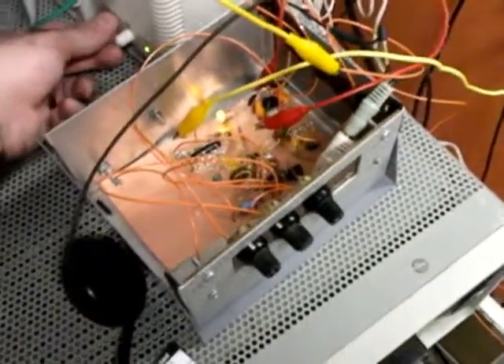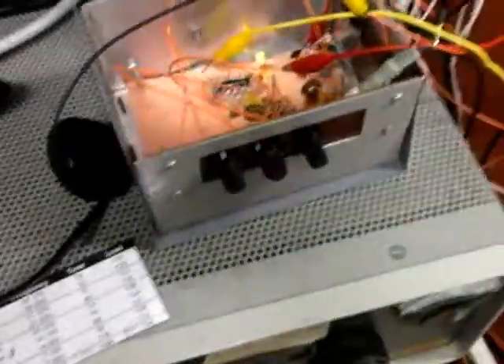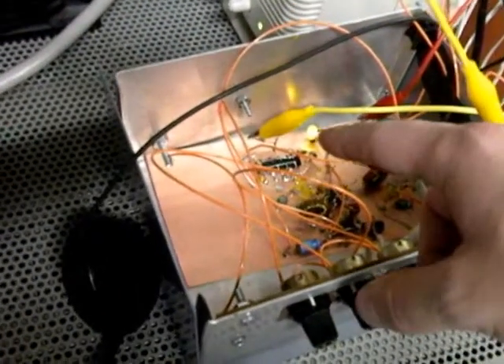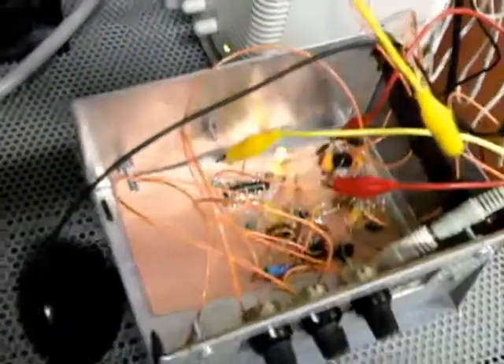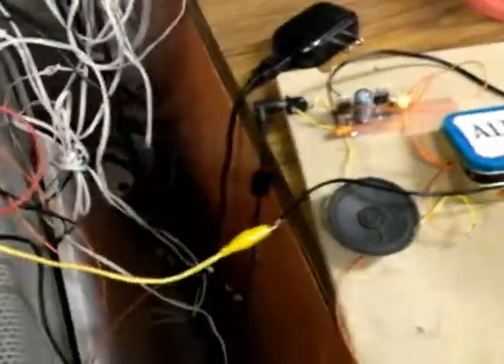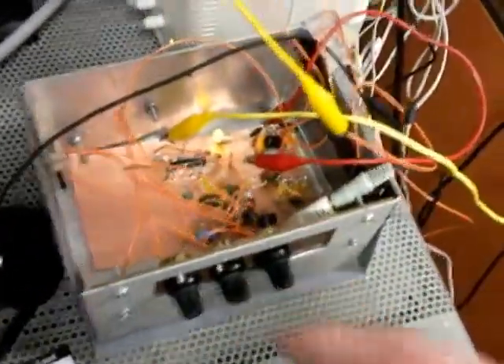Here's the receiver I designed a little while ago. I'm going to turn the audio down because it's really distorted the way it is right now. I am taking the oscillator output and amplifying it with a buffer chip to make it 5 volt square waves, and I'm sending it over here with a gator clip. This is not a very good way to do this — I'm getting a lot of noise and it's destroying my audio, but I'm just proving it works at this point.